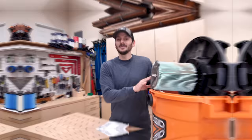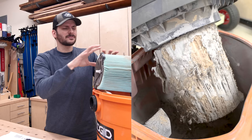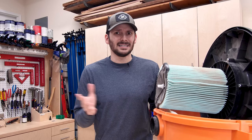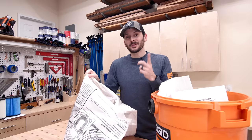Filters are great at getting fine dust out of the air, but they are not good at handling large dust chips. Tip number three: make sure you're using a dust bag inside the vacuum, because all that large debris will go right into your filter and clog it up — choking the motor and reducing the life of your shop vacuum. I use high-efficiency dust bags, and with a 12-gallon vacuum I only empty it maybe once every six months to a year. They're easy to swap out and come in all different sizes, so my filters stay clean and have a really long life.